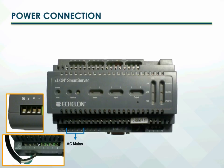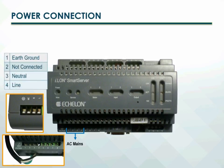On the PL20 models of the smart server, this connection is also used for the LonWorks network communication. The high voltage connection is implemented on screw terminals 1 (earth ground), 3 (neutral), and 4 (line). Screw terminal 2, NC for not connected, is not used and should remain unconnected.